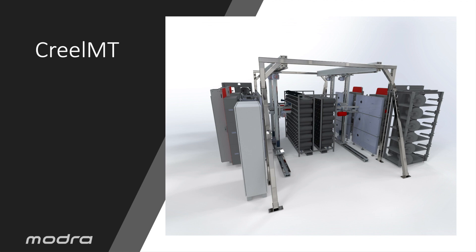A quick review of Creel MT. In this configuration we have a mobile creel of 250 positions with each position capable of holding 1,000 grams of yarn. There would be four such creels used for a two meter wide tufting machine. Twelve individual spindles are configured around the mobile creel and each of these are actually configured as a three high Gilbos Uniwinder.